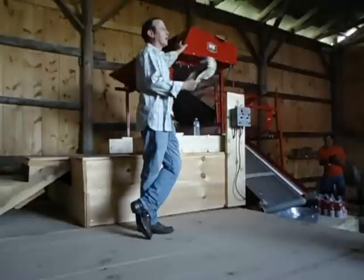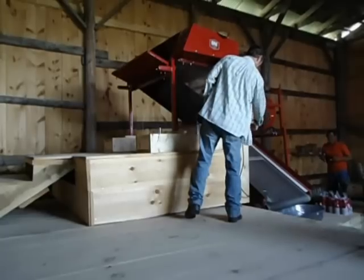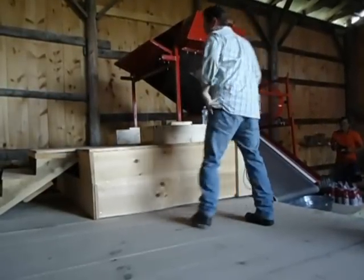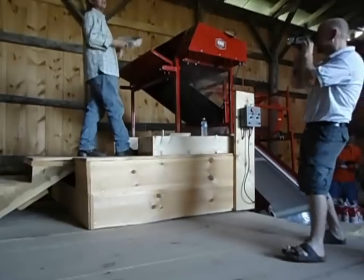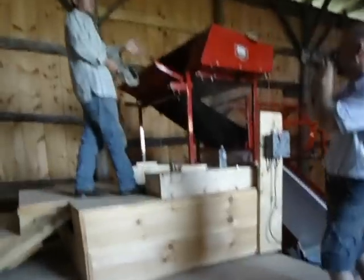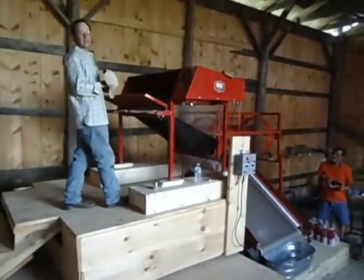But they actually do have some recommendations for speeds for the different varieties. If you strip the bine, the cones and the leaves are stripped off by stripping fingers here, which are basically the same as stripping fingers in any harvester. These are the standard stripping fingers. This one's a horizontal thing. Mark's grabbing some vines. I'll show you how it works.